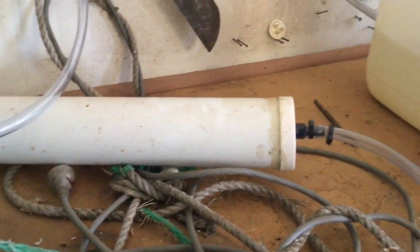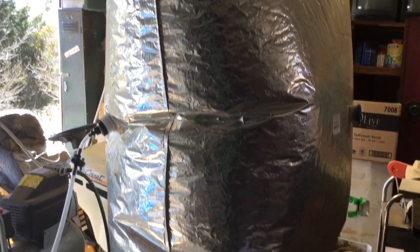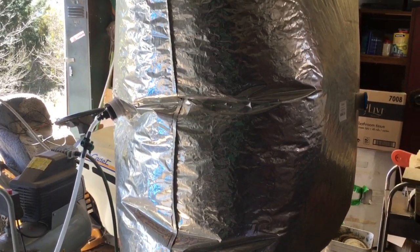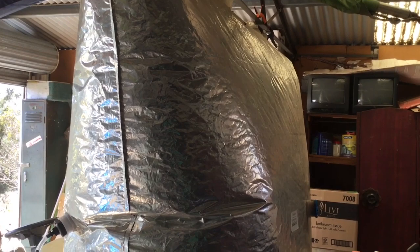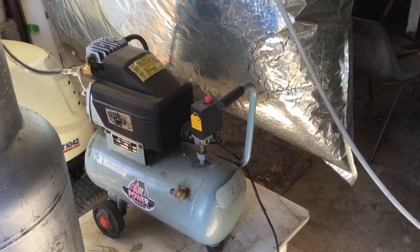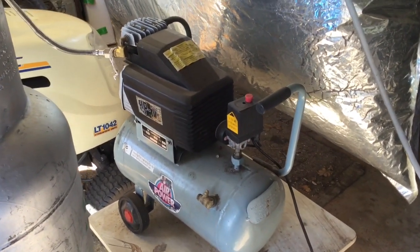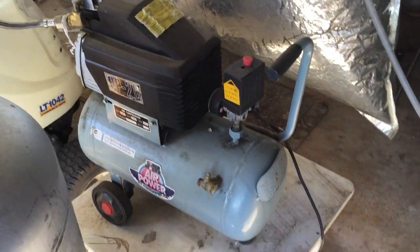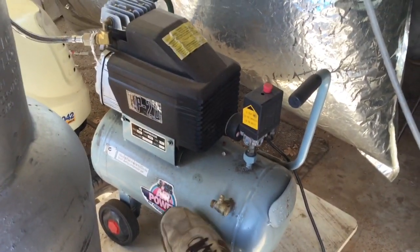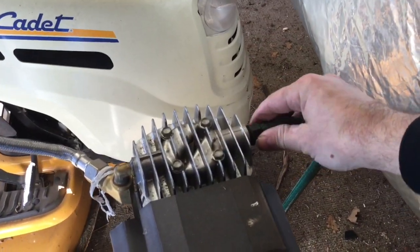As a secondary filter, I've just got another pipe here with steel wool in it to remove a bit more gas. All of this gets pumped into this big bag which I picked up from a winery — there's a video on this — it cost me $30 off Facebook Marketplace. For compressing, I use this cheap and nasty air compressor that I found in the shed. The tank is actually decommissioned so it's just running from the motor itself, and I've got a hose for the inlet with a barb fitting.